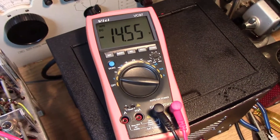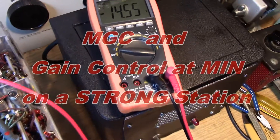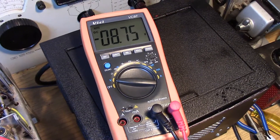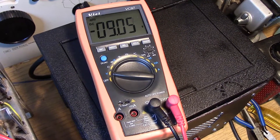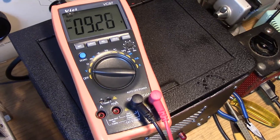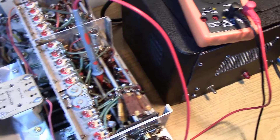In manual gain control, the AGC or gain is at minus 14 volts, which represents minimum gain on the receiver. Switching to AGC, we've got minus 8 on there. Tuning around, strong signals are giving about 9 volts of negative bias on the AGC. I think we're ready to do the final alignment and get the magic eye tube working — we have a good AGC and know it's working fine. I did replace the AGC capacitor, so it's very lively and working very nicely.